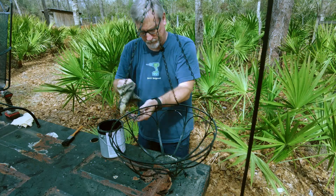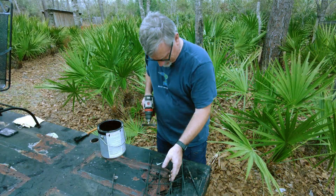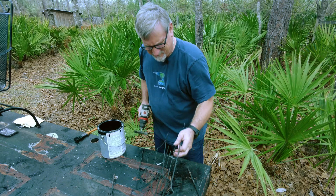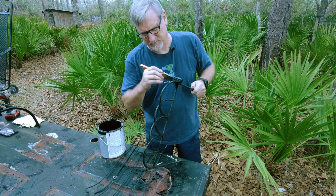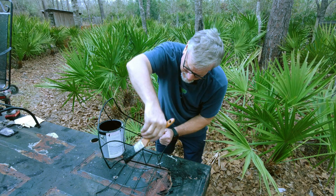You're also going to get paint on you — there's just no way around it. It's really important to get all the loose or bubbling rust off before you paint, because the paint isn't sticking to the metal, it's sticking to the rust, and it's just going to keep rusting. On these pieces I'm going to make sure I get two good coats, especially on the parts that get shoved into the dirt.